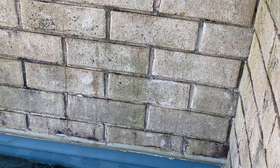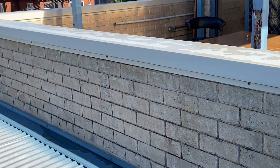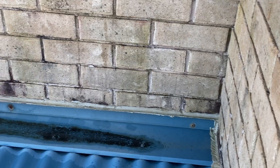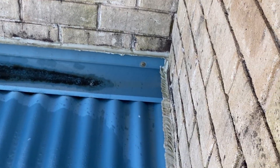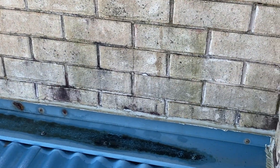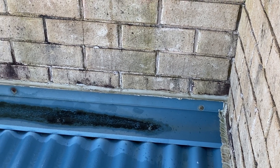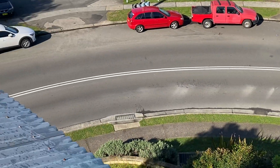You can see the gaps opening up to the brickwork and the cracks. The caulking needs re-completion. So clean and seal this wall, re-point those joints, re-complete the polyurethane caulking. Ideally there should be a pressure seal or an over-flashing put onto that flashing on the wall, and a gutter should be put on this half-round roof to dispose of the stormwater long term.